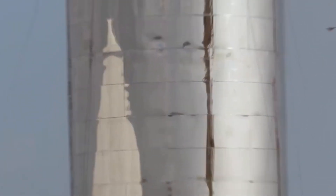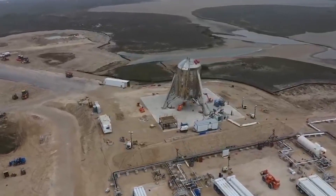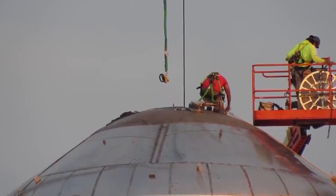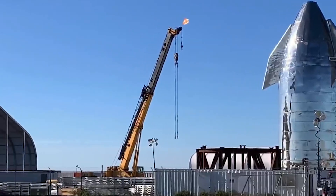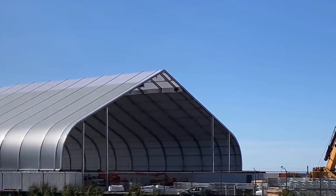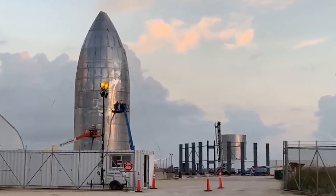Other welding methods require metal to be put through great temperatures, practically melting the metal. FSW, however, is a solid-state method of welding that only requires a tool that passes over the line to be welded. It works by generating friction as it goes over the line, producing just enough heat to soften the metal to the point that it's malleable. The tool then mechanically joins the panels while still malleable — similar to working clay or hammering preheated metal into shape. It is described as a forging process.